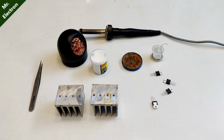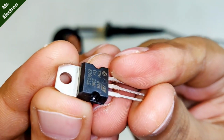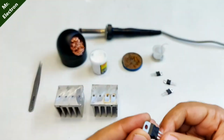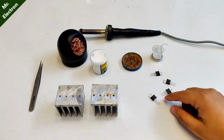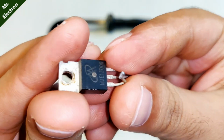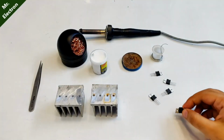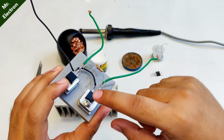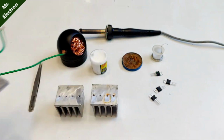So let's start with the power transistor that I'm going to use in this project. Here you can see the ST13009 power transistor. I'm going to use 4 pieces of these. If you don't get these or don't have these, you can also go for this MJE13009 power transistor. Works just the same. And I'm also going to use this inverter circuit that I showed you in my previous video. If you haven't seen it yet, the link will be provided in the description, so don't forget to check it out.